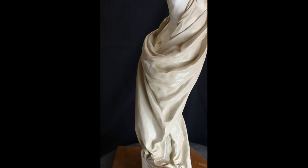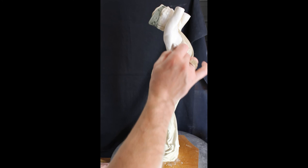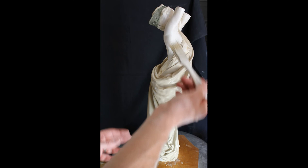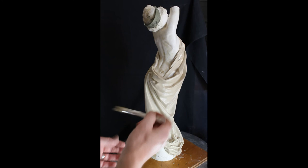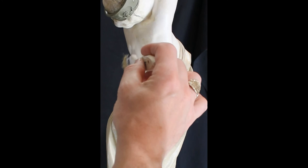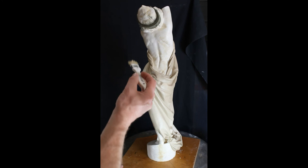And this also helps when you're putting on the silicone. In some areas, you may need to get a little deeper and you may have a tendency to kind of strike. This clear coat helps these little bristles not go into the clay. It makes it a little more resistant to impact for the bristles. I do this with the oil-based clay. I don't necessarily do it with the water-based clay. You find out what works for you, but I just want to point out that this isn't a best practice anyway. We want to sweep the silicone in when we get to that part. And in some areas, you're going to have to push the silicone in there or put it on your glove and wipe it in. But really try to brush all of your silicone in.